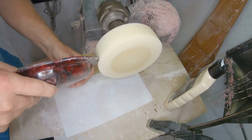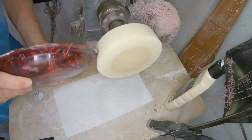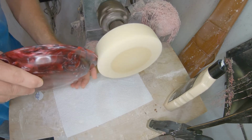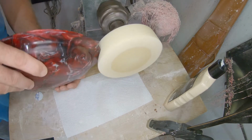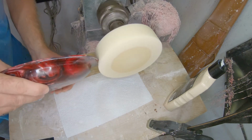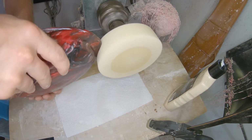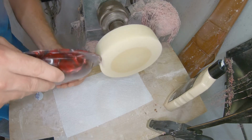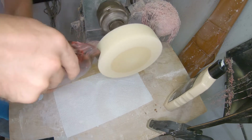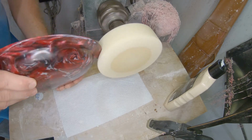And don't forget your edge. You don't have to bear down doing this, because when you bear down, it increases pressure. Pressure means friction, and friction means you'll burn the finish, which will also make you leave the shop because you've got to start all back over. A lot of people won't do this because it just takes so long. But once you do one with a high gloss that's like a mirror, shine juice is just never the same.